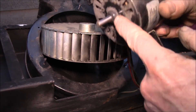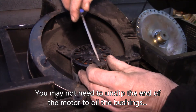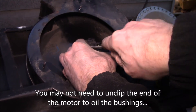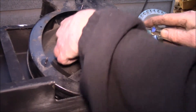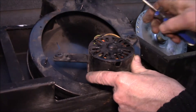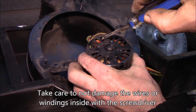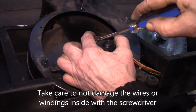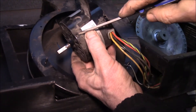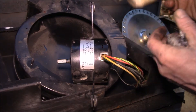To open the motor, pull the four clips and lift the top of the motor out — there's one bearing at the top and one at the bottom. A narrower-bladed screwdriver works better to catch the end of the clips. One clip is tricky because it's got all the wires and there's a piece of metal behind it. Once the end is open, there are two oil ports — I didn't even see the one on the bottom at first.